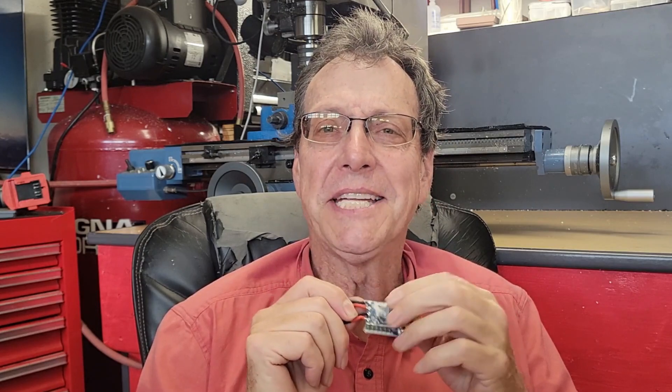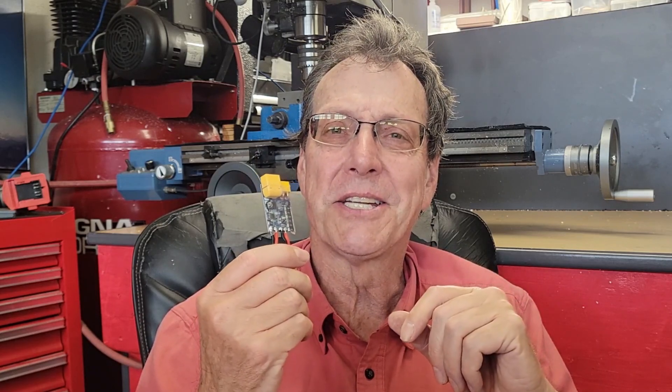I was using it because I really liked the on-off switch. It allowed me to cycle power easily on the aircraft, but once I started spinning the motors, the system would pull too much current, and I took this out. Immediately one of the motor speeds got away from me, and the ESC went up in smoke — it actually went up in fire. I'll show you some pictures of the damage to the wing and the airframe. A little bit of excitement there.